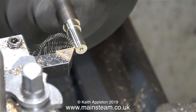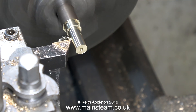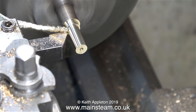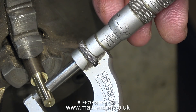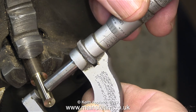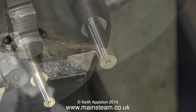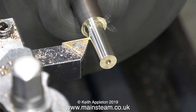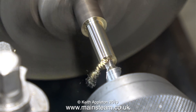If you use coolant in the lathe you're able to turn at a faster speed and take a deeper cut — but in this case, what's the rush? After all, it is a hobby, not a commercial industry. Another check with the micrometer shows the piece of bar is two thou over the required size of a quarter of an inch. If I set the cross-slide handwheel to a one thou division, then when I turn the part, two thou will be removed from the work.